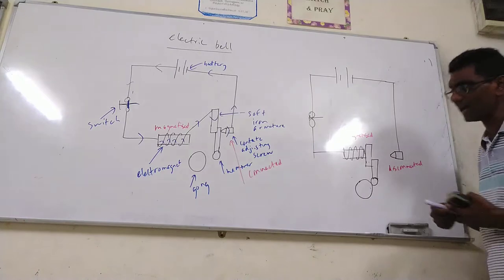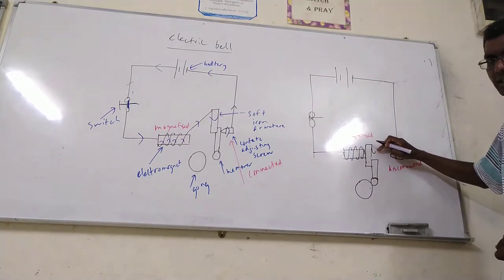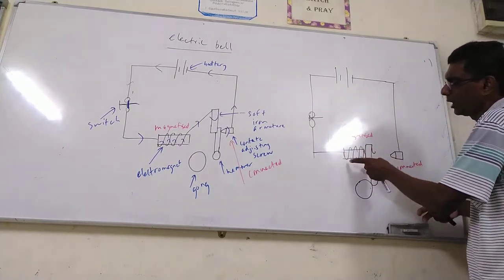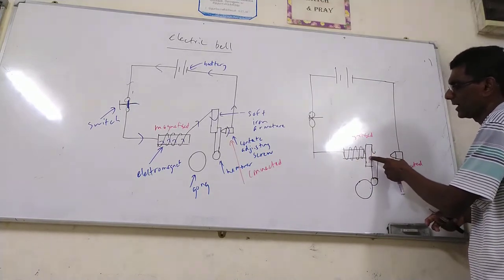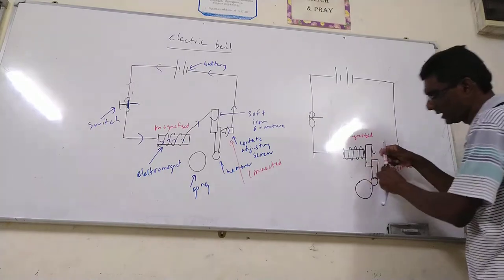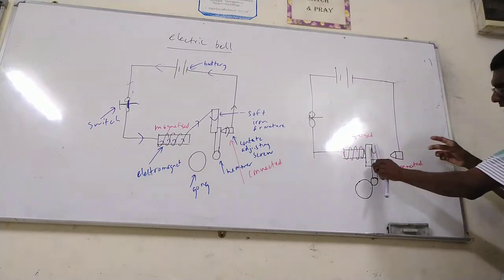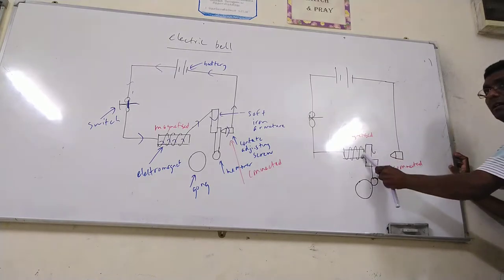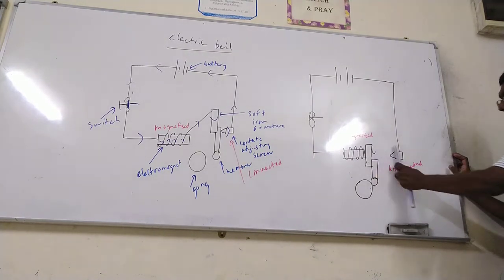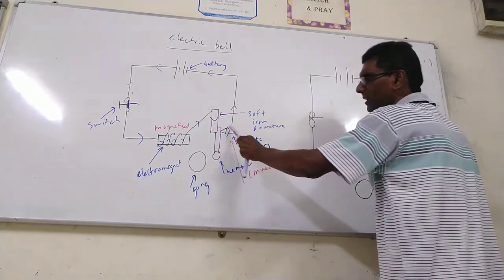As a result, there's a spring at the back of the soft iron armature. So the spring pulls back. There is no more attraction between the electromagnet and the soft iron armature. It's normal iron now. While the electromagnet was pulling, the spring was stretched, so the spring will pull back and touch the contact adjusting screw. The soft iron armature touches the contact adjusting screw again.